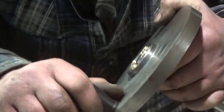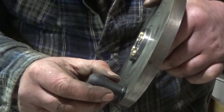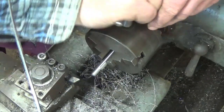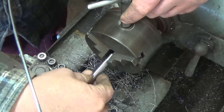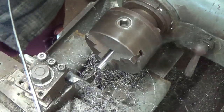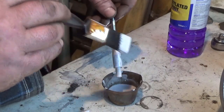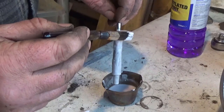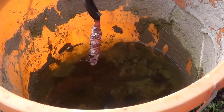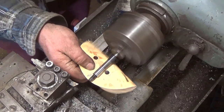The original plastic knob was horrible and way too small for my massive mitts. I enlarged the hole from M6 to M8, turned the shaft and put an M8 male thread on one end with an M6 female hole in the other. The shaft was coated in a mixture of methylated spirits and talcum powder to prevent oxidisation during the hardening process. Following hardening, the shaft was polished.